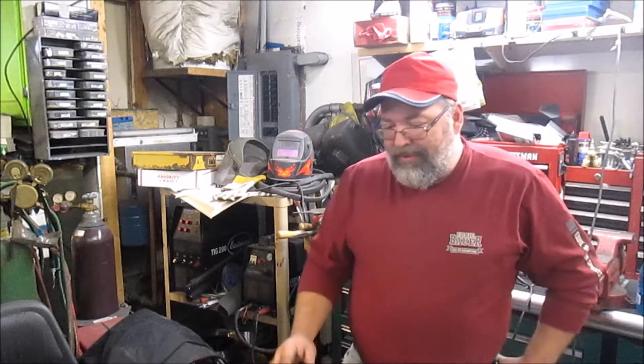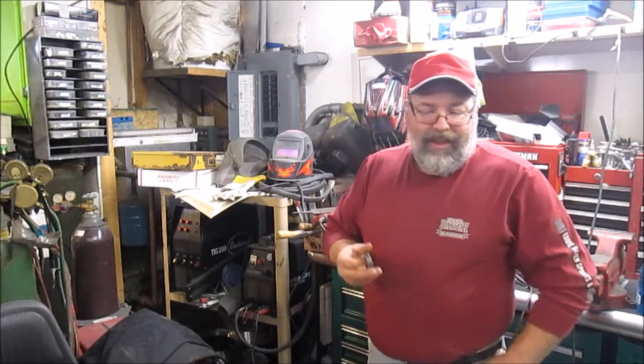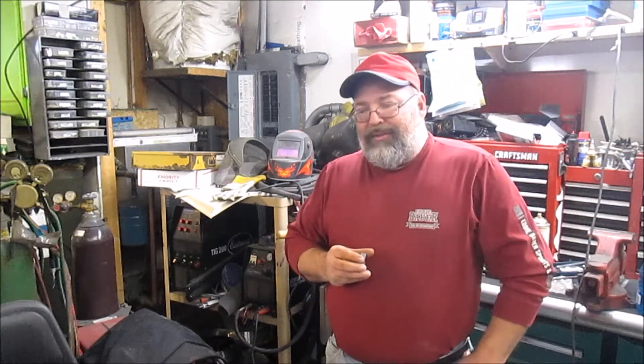Still have to get that fitted — I haven't done that yet. But the first problem I was having with some of the other welding was that I was using 035 wire and it's a little thick. Too much voltage, it burns through a lot. I do have a spool of 023 wire that I had picked up to do this project.